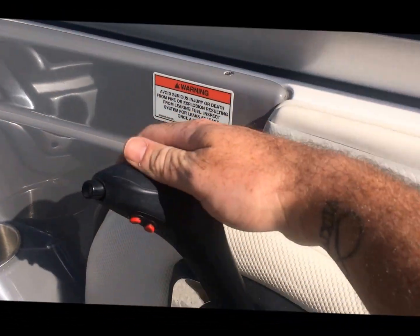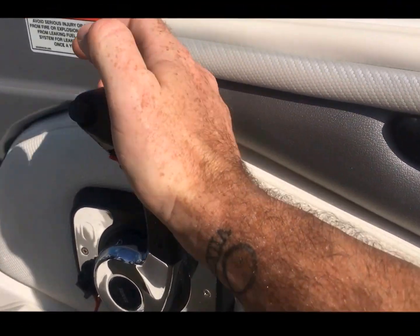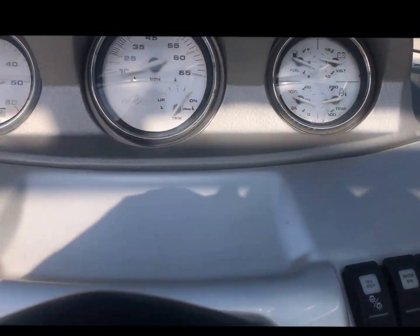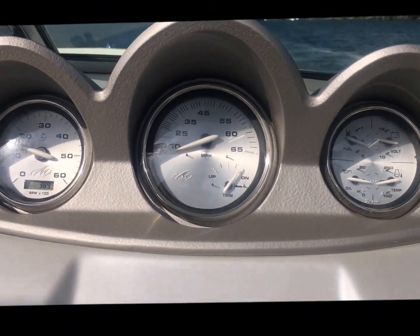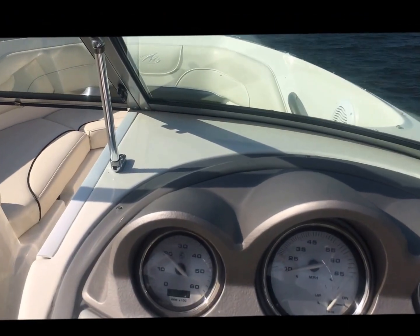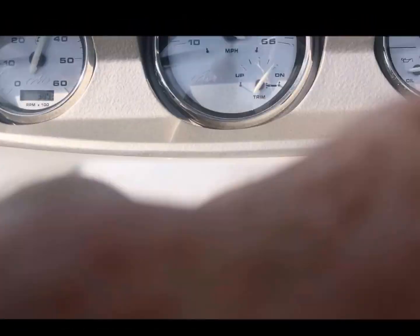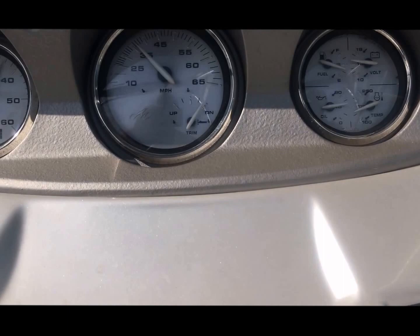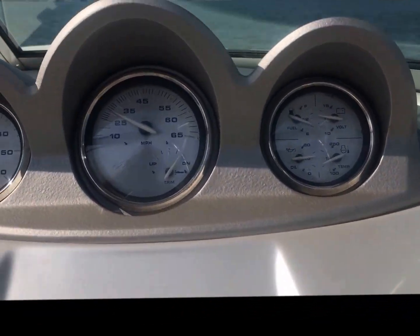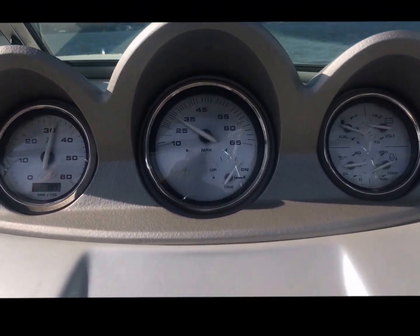Forward, neutral — you always push the button in and your trim is here — and reverse. So let's go ahead and ease into her. It's got the dual prop, so it'll set this boat right on plane. We'll get an angle going so we can see both. See it already settled down and we're not even at 25 miles an hour. That's how you know the boat's powered well — when you're running over 30 and you're at 3,000 RPM. If we were running 30 at 4,800 RPM, that means we've got too small a motor for the boat.